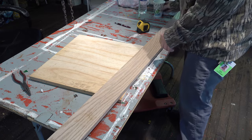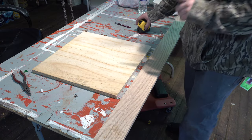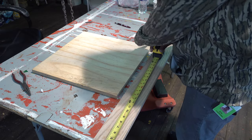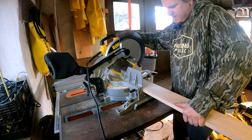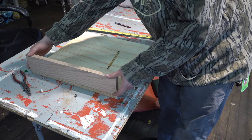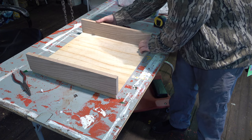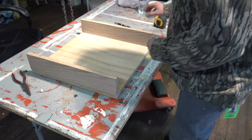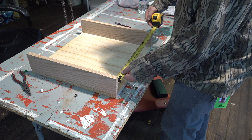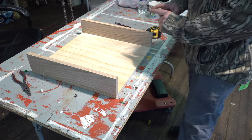I actually went to Michael's today — I am not meant for Michael's. Since I know that this board on two sides will for sure be 18 inches, I'm going to cut two sections at 18 inches, and then figure out what the size is in between the two boards. That fits on there pretty darn good, and I'm going to fasten these so my dimensions won't change. Right now we're looking at about 16 and a quarter on the inside gap.